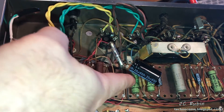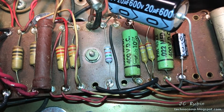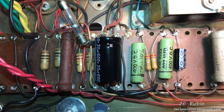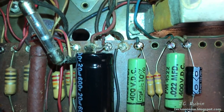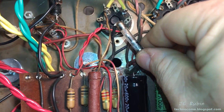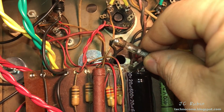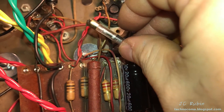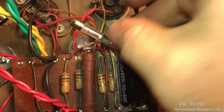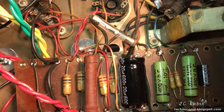I'm going to find a final way of hooking in this capacitor. I've run a ground across here in support of this 20 microfarad capacitor, and I'll now bring the capacitor over and swing that down to ground. The capacitor is now mounted properly - we can see the ground over here, the tie-off going to the tubes up top, and onto this fuse here. This is not in the schematic, it doesn't belong - at best a kludge. This should go because this is just a wire soldered onto a fuse, so I'm going to take this out and solder the wire back to the board.